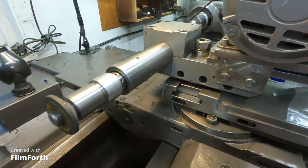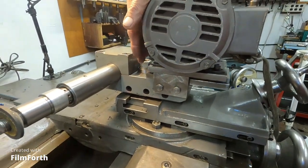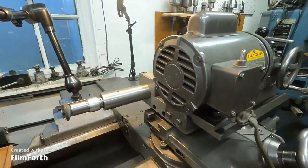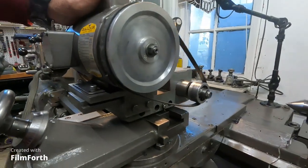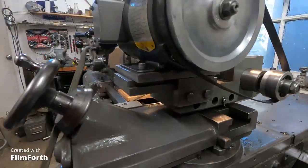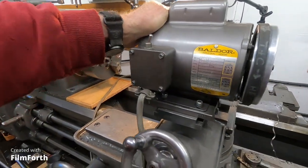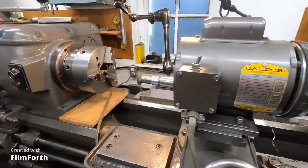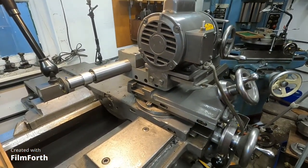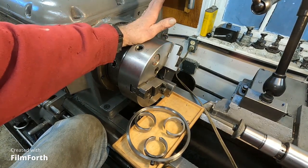Yeah, so this is the equipment here. I fabricated this. This is 2-inch plate. I got angular contact bearings in this spindle housing here. It's running about 10,000, I believe, with this pulley setup. Okay, quite heavy, half horse high-speed motor. Okay, so I will get even more set up here, and to that all-important loading the jaws.